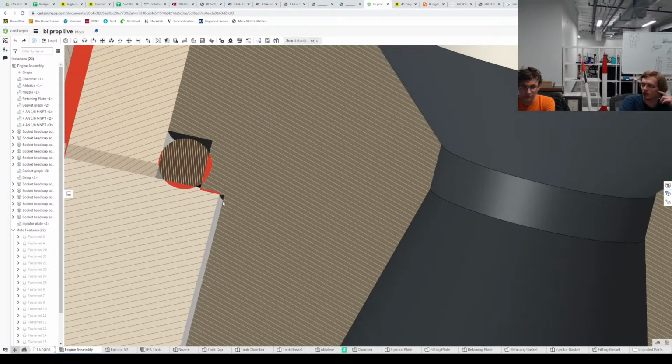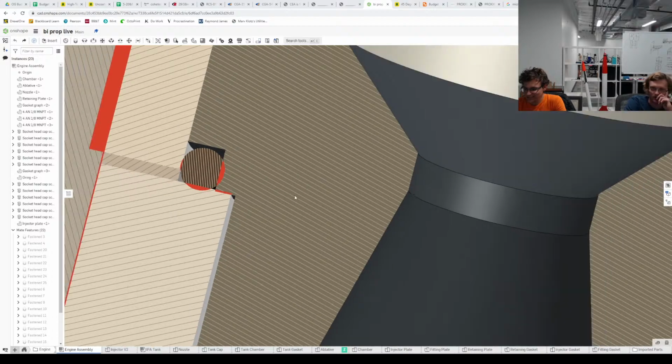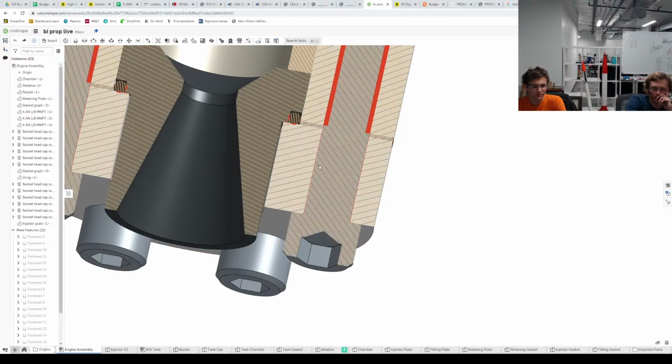We got a 21 millimeter drill bit. Look at that, 21. There's one right here. It's $37 though. There's no way we can get $37 off the price of this. You could switch to an orifice plate nozzle. Chamber pressure will be affected. Oh, just a plate there with a hole in it. I would prefer not to do that. We already purchased these. But if we get a 21 millimeter drill bit, boom, right there, we've got the clearance we need, but $37.